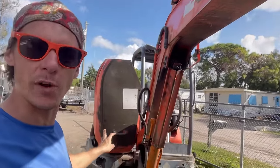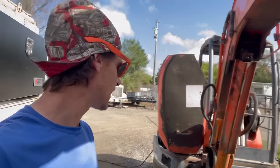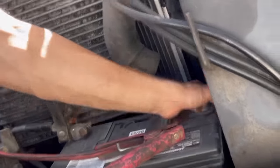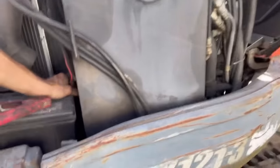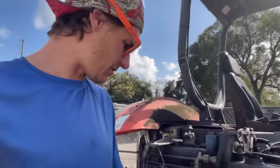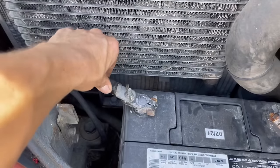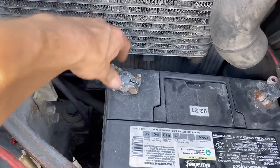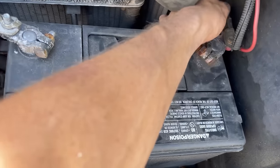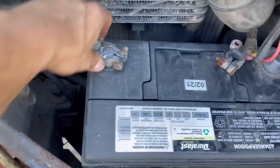First little loop of the day — the machine's decided it doesn't want to start again. It sounds like a battery because it's just clicking. I came over to the battery cables and you can see how loose that is. I'm not here to play mechanic, just trying to get it running again. It's literally none of it is tight, so I'm going to have to fix this.